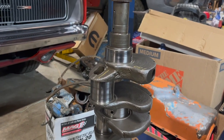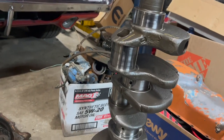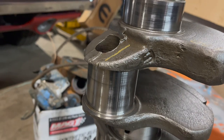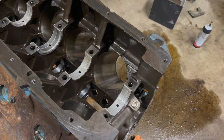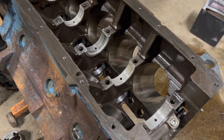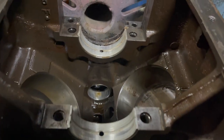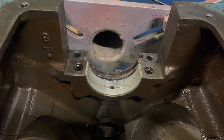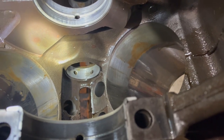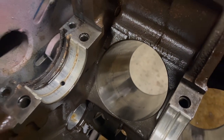Checking everything is obviously a good idea, and all the horrible milky oil wasn't great, so I did remove all that. I think we got a good one. There are some visible lines here but nothing that can catch a fingernail. It's not just good — it's good enough. I've said many times that the key to being good at anything is knowing what you can get away with. Look at these bearings — they look great. Sure, there are some little shinies, but really nothing major. I don't think it's been many hours since this engine was overhauled. The heads look almost brand new other than the rust. Cam bearings — they're fine. I've seen so much worse. I'm going to give this thing a fresh hone and call the block ready after a really good cleaning. I didn't think I'm going to do the freeze plugs — they're fine.